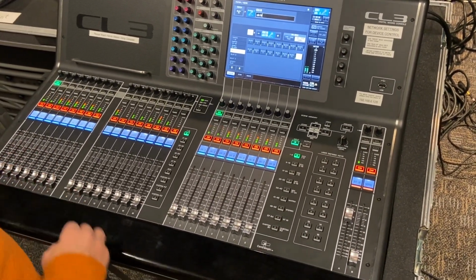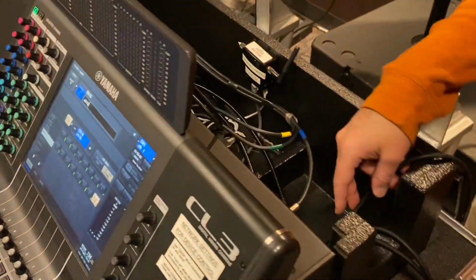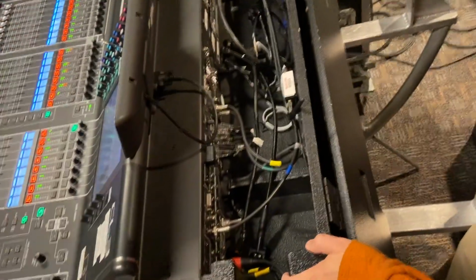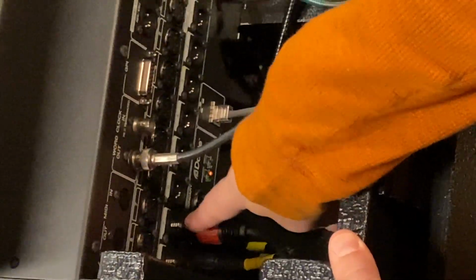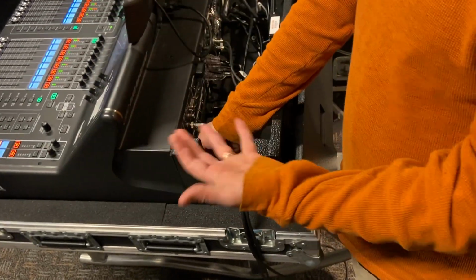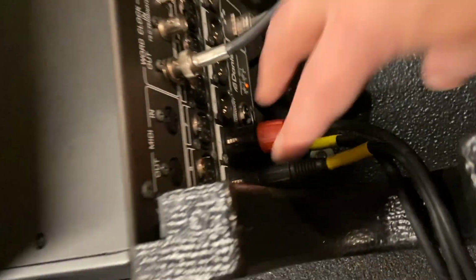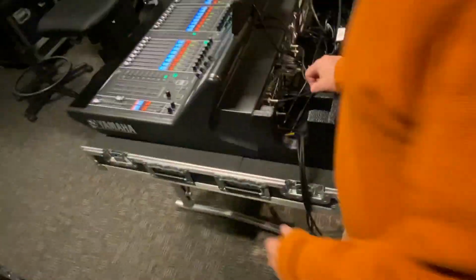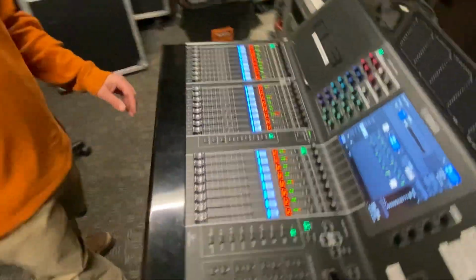And I hear it because, by default, the way the console is set up, Omni 7 and 8 are going off to the control room monitors. Or they're usually going off to the, sorry, I should have said that all wrong. They're going off to the mains, right? Mains left, mains right. And now that we're in a little control room, where we're going to use those for left and right, the problem with that plan is about gain staging.